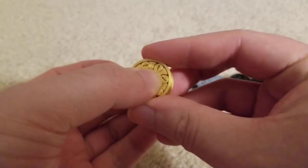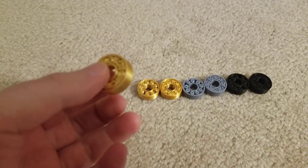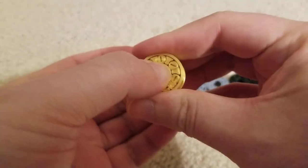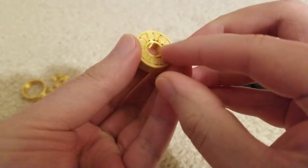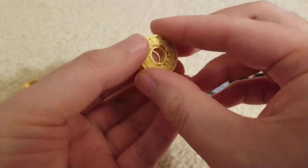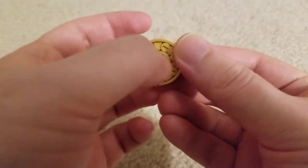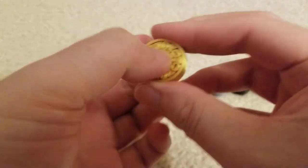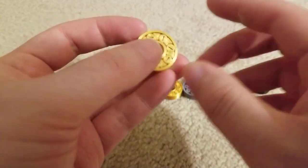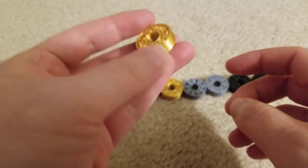The first set I printed off are these, and they're just stuck. I printed these at 0.2mm layer height. I tried everything — I tried sanding because I thought maybe the first few layers were sticking. I did eventually break off a small ring from the bottom and the center point spins somewhat freely, but none of the other parts do. I accidentally broke the little balls inside, so this obviously didn't really work at all.